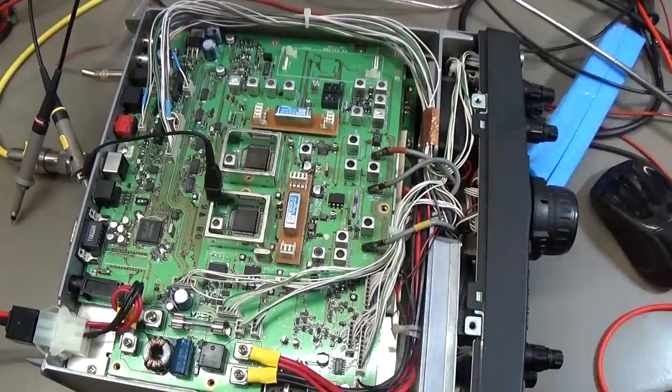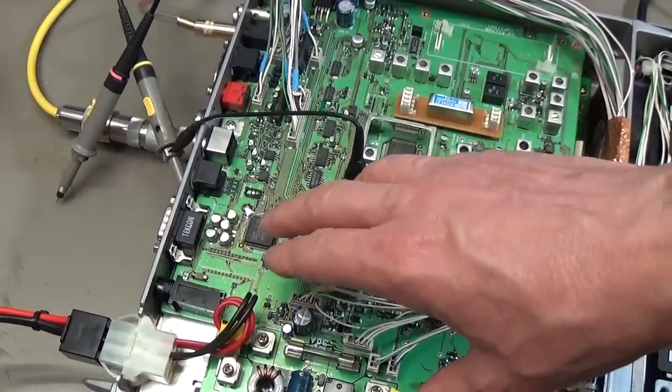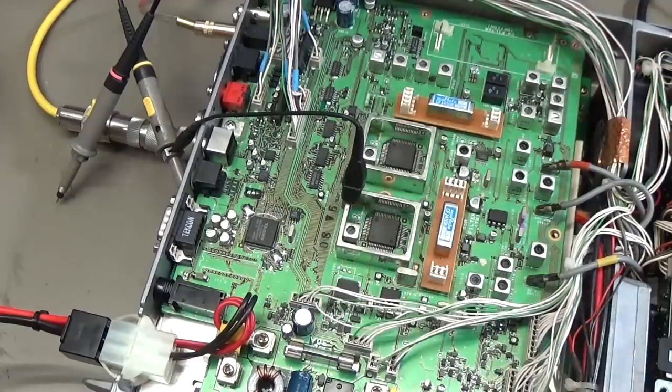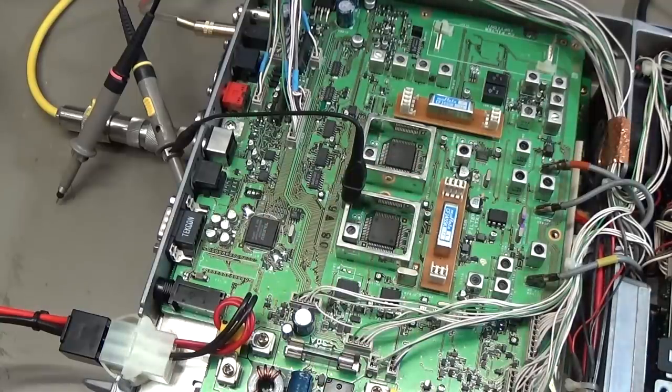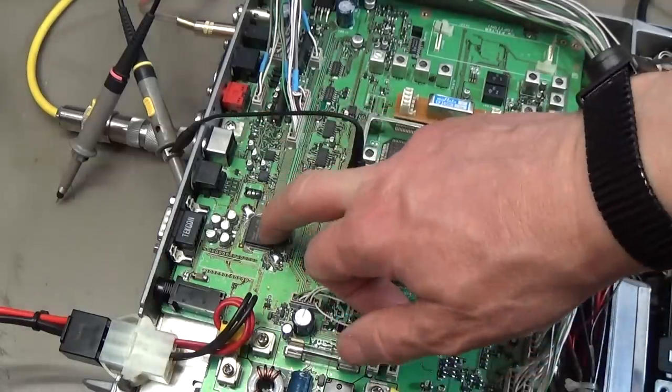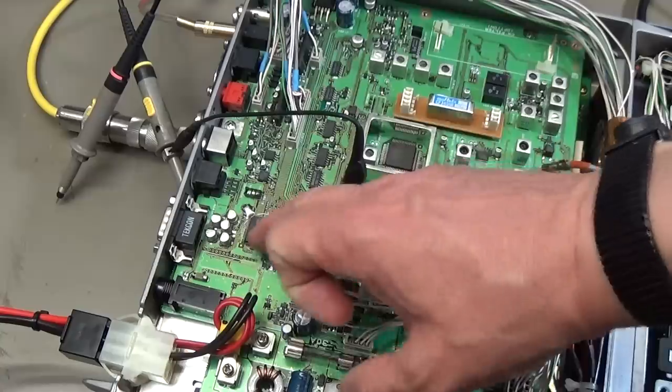And my conclusion is that maybe while all this work has been done, an ESD pulse hit our processor, because I have seen processors which get an ESD pulse and just stopped working partially. So you have a lot of working functions. I've seen that I think 5-6 times, so that you have the processor working in some regard, but you have one portion which is not working properly. And I believe that we have a similar situation here with our main processor, that it died partially.